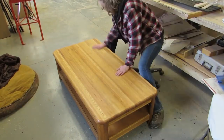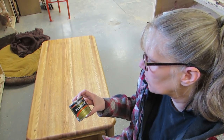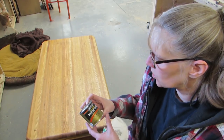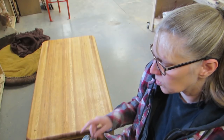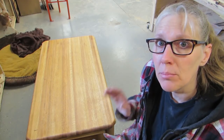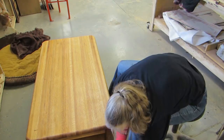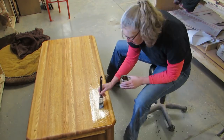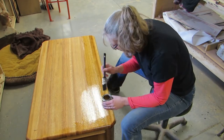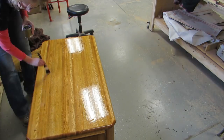And I used 220 to smooth the finish. I got this all back together now and I'm going to put another coat of this polyurethane clear satin. I used the spray stuff and I'm just not sure how much of it got on there. It says to put on a real thin coat and then wait three to four hours, and lightly sand and apply another coat if desired. So I'm going to do that. Boy, I really like this brush-on poly, and what a difference it was putting it on this table compared to that spray can poly. I think there's a place for the spray can stuff, but in this application, this was the way to go. I'm so glad that I put this on here.